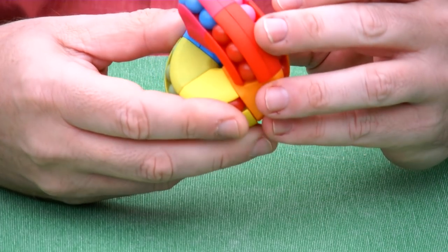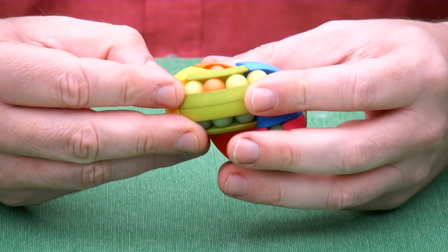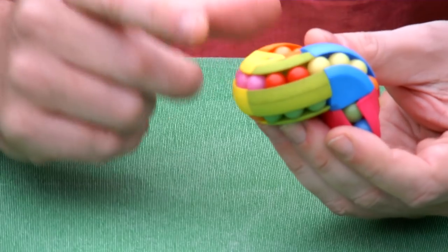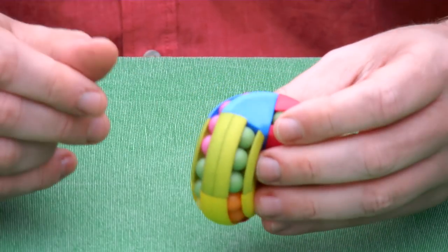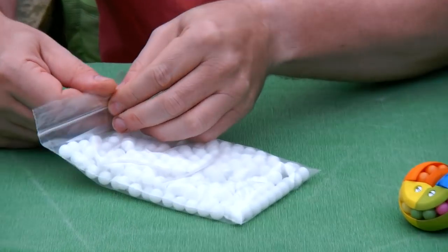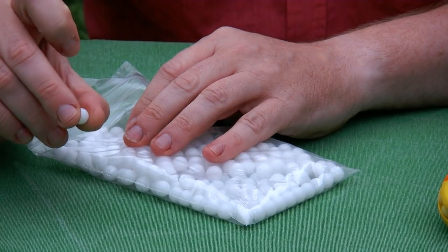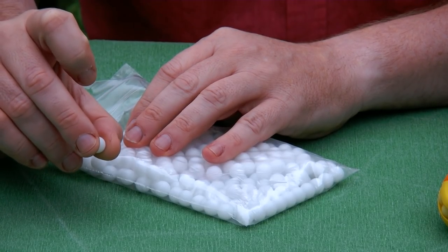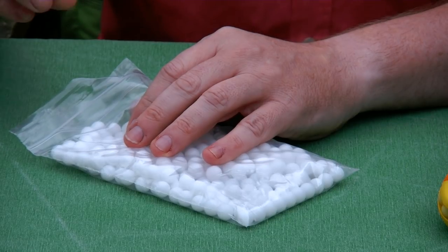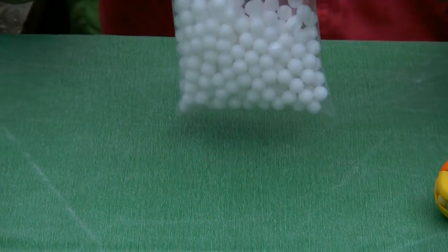What's special about this puzzle is the balls I have used. In previous designs I used 3D printed balls but they don't slide that well, whereas you can see these turn very nicely. After a big internet search I found these bright white balls made of the plastic Delrin. I measured them — they are 10 millimeter, not just approximately 10, they are 10.00 millimeter, as accurate as I can measure. Apparently these are used in valves, but given that they are extremely smooth and highly accurate, they are perfect for this puzzle.